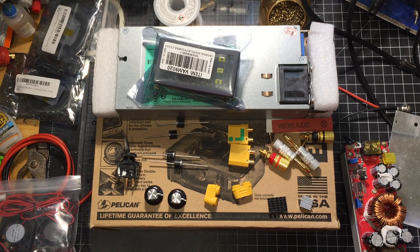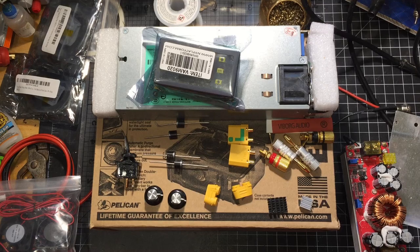And I probably could go higher on the amperage, because I believe the batteries I have say that you can charge at a max of 1.6 amps, consistently. But I'd like to keep it down. And I also don't want to charge my batteries to 4.2, because I also did a lot of reading on e-bike batteries. And it seems that if you can keep your batteries between 4.1 and 3.5, they tend to last a lot longer.